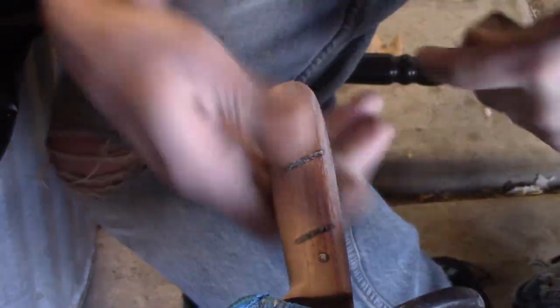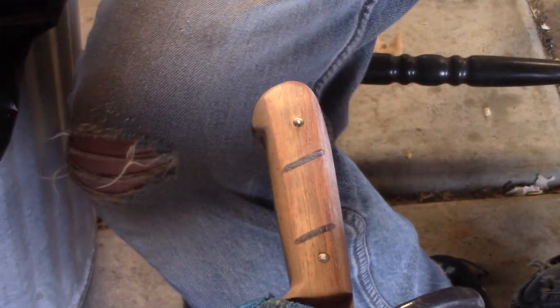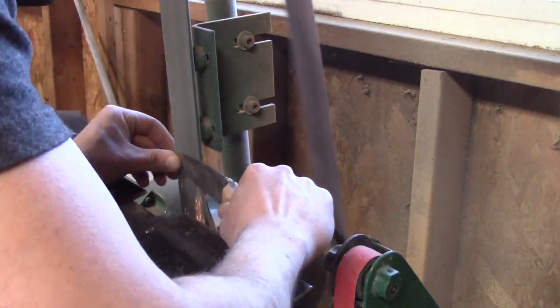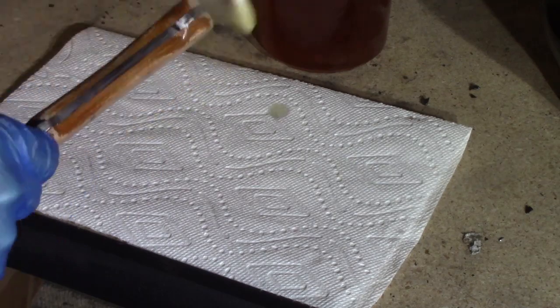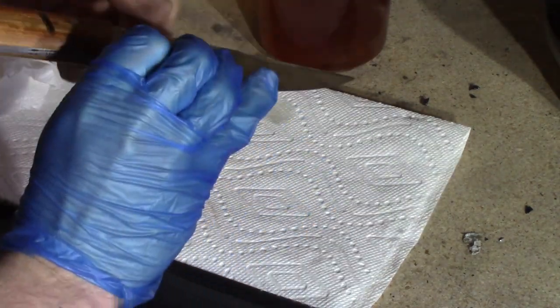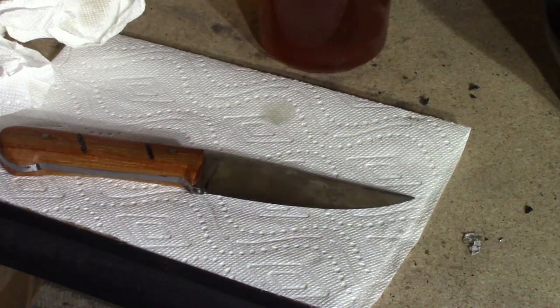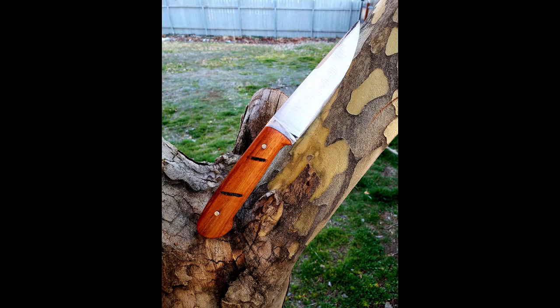There are tiny little pieces of sawdust in between the obsidian, so I use a toothbrush and keep sanding until the handle is how I want it. Then I use my gator belt to finish up the blade, and use boiled linseed oil over the handle and obsidian to really shine it up. Alright guys, let me know if you enjoyed this video. If you want to see more videos like this trying different handles, hit that like button and subscribe — I'll see you in the next video.